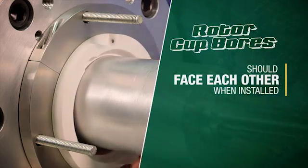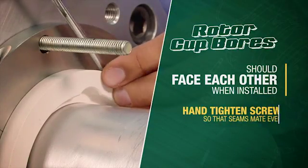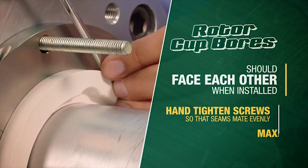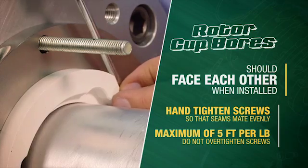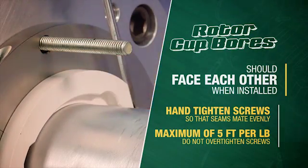Rotor cup bores should face each other when installed. Hand tighten the screws so that the seams mate evenly. Apply a maximum of 5 foot-pounds of torque. Do not over-tighten screws. This may cause damage to the PTFE rotor cups.